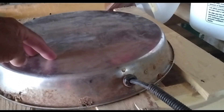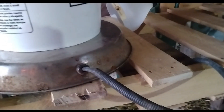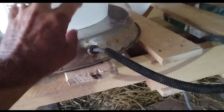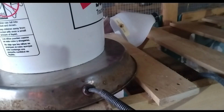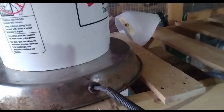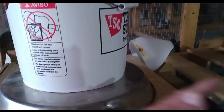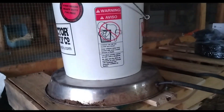I'm gonna have a bucket on top of the heater. The water will come out from here. So the lower part — even if the top freezes, the bottom will not be frozen because of the heater, and the pump will pump it. So it will continue circulating into the pipes through all the cages and come back to the bucket. In this way it will not freeze in the pipes as well.